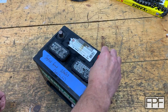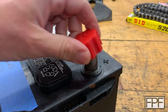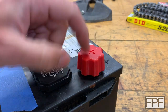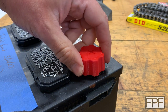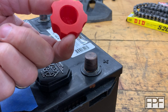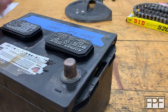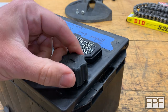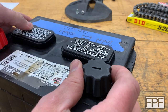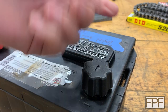Oh, that actually fits — it fits really nice. It kind of twists and gets you down closer. I know you guys at home can't feel this, but as I set it down on there and give it a little bit of a twist, it basically locks in place. You see how this guy's not loose at all — you've got to twist it to get it to unlock. So we're definitely not bottoming out on the bottom here, and I think we are basically fully seating on that taper. Let's see if the negative side is just as good. It feels a little bit looser, but I don't think it's bottoming out — I think maybe this terminal is just smoother. I've got to push a little bit harder on this one down as I turn it to lock it, but this one seats on that taper nicely as well.